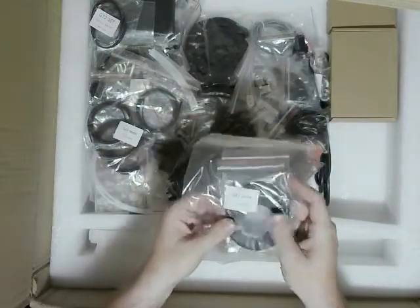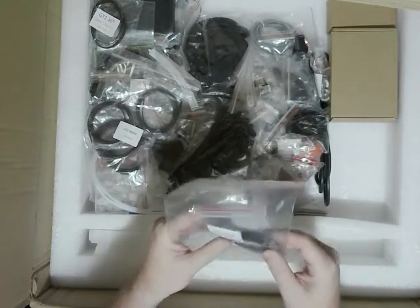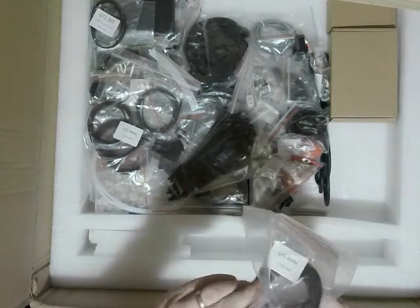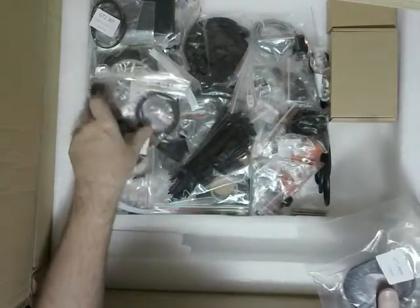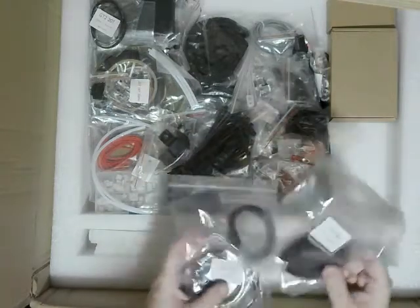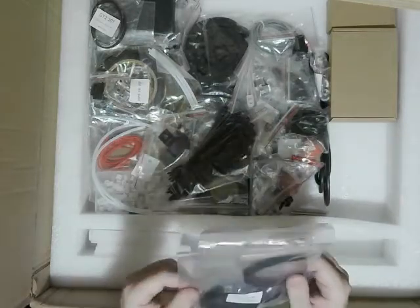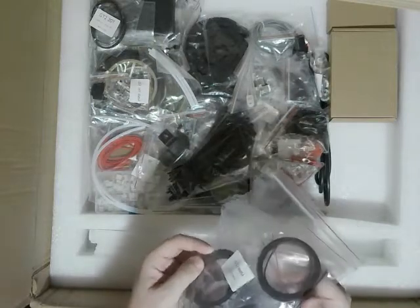Okay, belts, GT2 6mm, 6mm wide, 1.6 meters long. Says Gates power grip. So various other people have commented there's a drawback. These belts are pre-cut, so you have to hope that the length specified was correct for your machine because you have no spare. Here are 9mm wide belts.